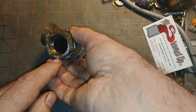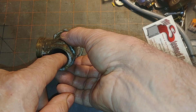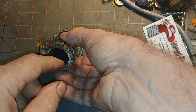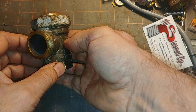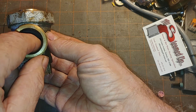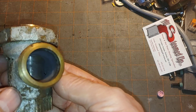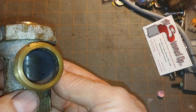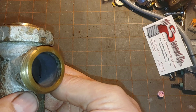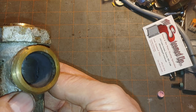We have a three-quarter inch inlet. This is where the steam and the air would arrive and it exits through there. That's almost closed, but not quite. Let's see if we can get a close-up — you can see, maybe on the right-hand side, a slight peeking out of where the steam is restricted.